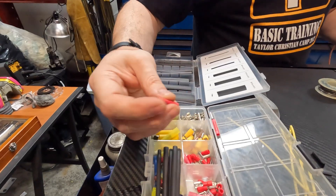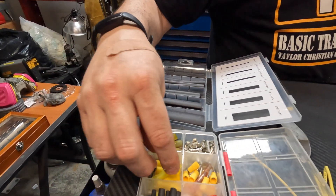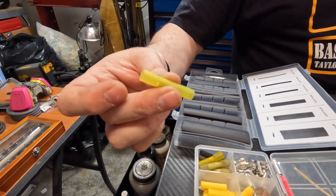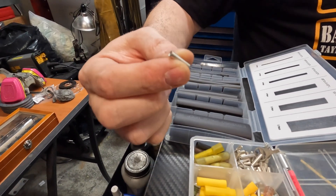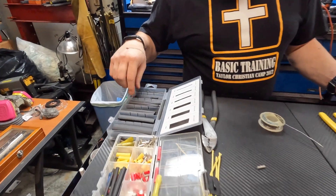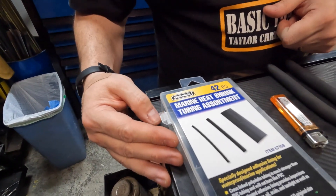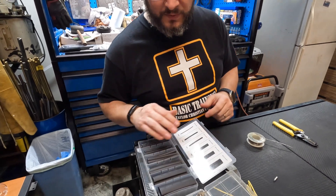Is there anything stronger than soldering for electrical connections, like butt connectors? Butt connectors are basically the worst thing you can put in. They are quick and easy, but they will not hold up to what a solder connection will hold up to. Most people in the mechanical community that work on cars use butt splices — I'll put your email down below so they can send you the hate mail. If you're underneath your dash you'll get away with that, but if you're going to be outside underneath the hood, you're going to want heat shrink connectors — though if you don't have the right crimper, these don't work all that well. You can also use a non-insulated connector. You want to get the good double-wall heat shrink — in this case they call it marine heat shrink. This has a nice glue inside that gives you a waterproof seal after you've done your soldering joint.